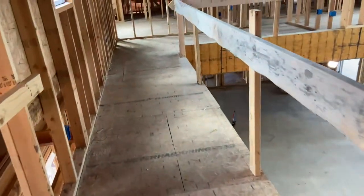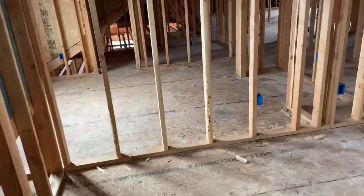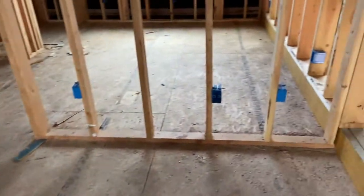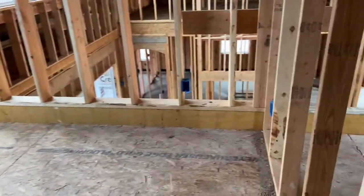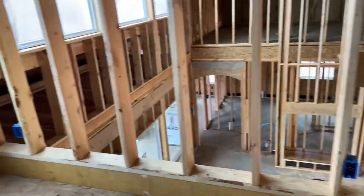I'm trying to keep this moving — I don't want the video to be too long just panning at outlets. Going down the hall keeping to code: an outlet every 12 feet and then some. Moving into a kids' bedroom: same deal, outlets everywhere, all at hammer height.